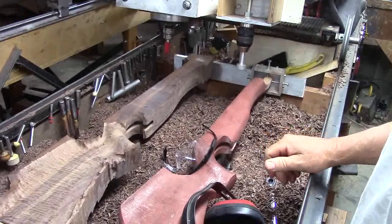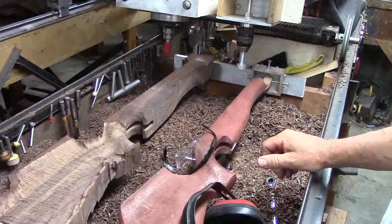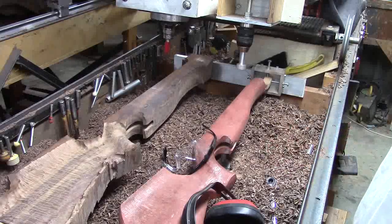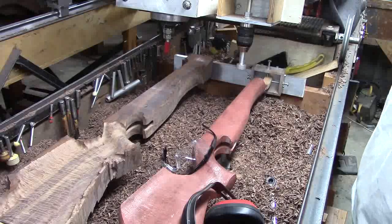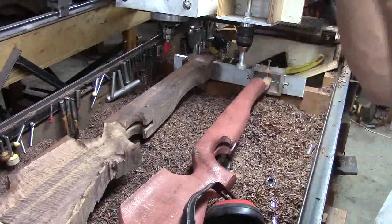Oh, and there was another little project I did. The front fence was falling down, so I dug some post holes and put new posts in. And I've got sand here, this volcanic vent that I'm living on. So I just put the posts in the ground, packed it with the sand a few inches, a little bit of misty water, and packed it with a tamper and a few more inches, and built it up. That stuff's in there like concrete. And I think it'll be easy to replace in half a dozen years when the pressure treated wood rots out, because of the high quality wood that we get these days. That's a different subject. Alright, I'm going to get suited up and I'm going to do some carving.